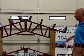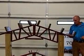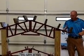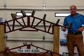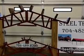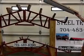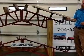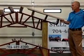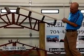The gable overhangs and fascia. So number one, our side overhang, this side part of it is called the eave. Our eave overhangs vary within length of the metal between this portion here, 16 inches and 23 inches. However, when we put the metal on, you typically overhang at 3 inches here. So for all intents and purposes, you have a 2 foot overhang. Sometimes a little bit less, sometimes a little bit more, but it's all very close. So it's a nice healthy overhang.